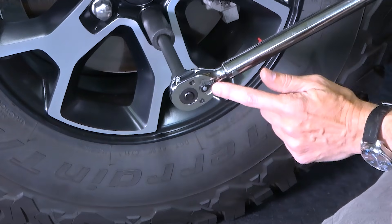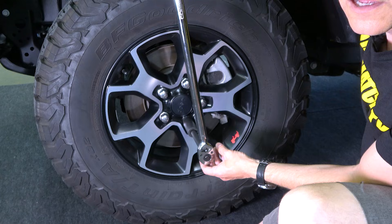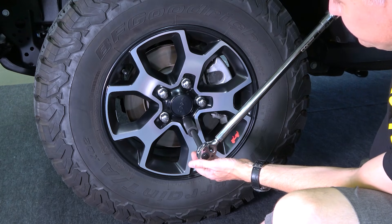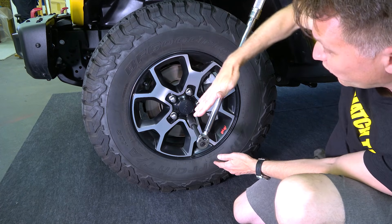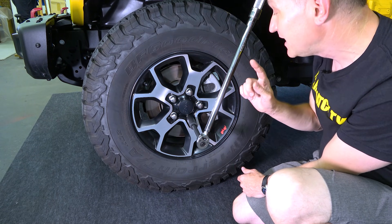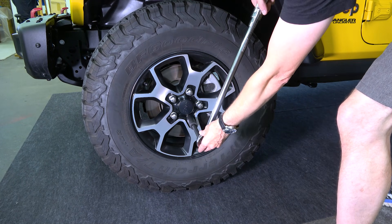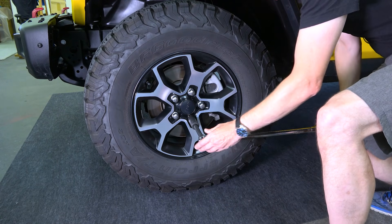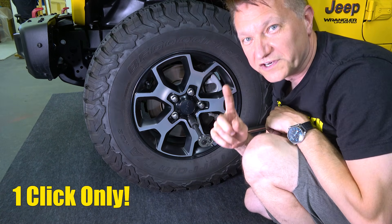The little lever here determines which way it's going to tighten, so I'm going to turn it that way. If the bolt is loose you want to pre-tighten it until you get a little bit of tension on it. Then I'm going to pull through in one smooth motion, and when I hear the first click I'm going to stop. I'll put my hand here to hold it in place and with my other arm push it down in one continuous motion. First click — and when I release, that's the second click. Just one click.